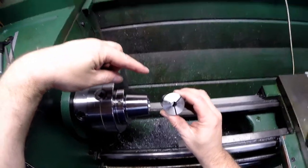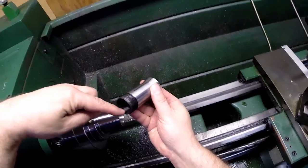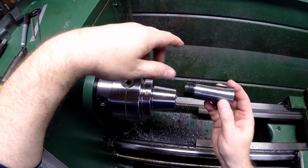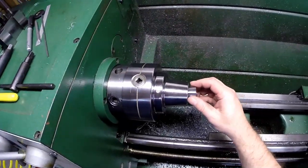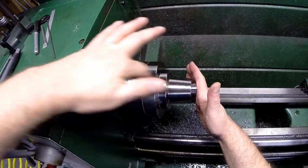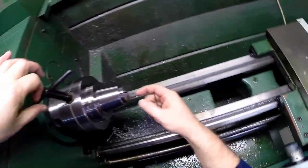In this case I'm working with a standard collet. On the front you've got a taper; in the back you've got an OD thread and an ID thread — I'll explain the ID thread later. The OD thread is what the collet chuck clamps with. It also has an alignment or drive key. We find the key, push it in, and just like a 3-jaw or 4-jaw chuck, you pull it in. As you pull it in, you can see the collet going in and clamping down.